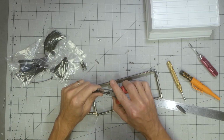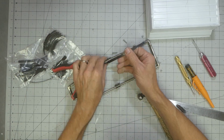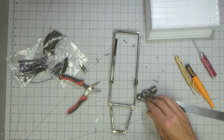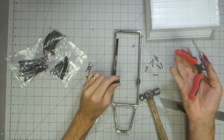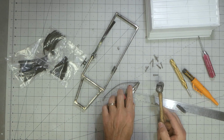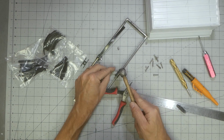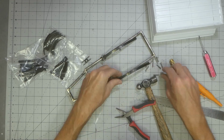The rectangular frame was designed so the leaf springs could be mounted directly to it without any spacers. I am using Extra Speed leaf springs. These are close copies of RC four-wheel drive springs, but they are not exactly the same. One difference is they do not come with the shoulder bolts. The shoulder bolts are what is used to allow the leaf spring to pivot.